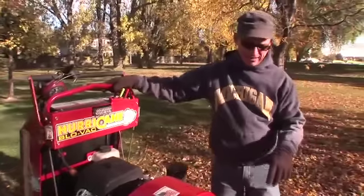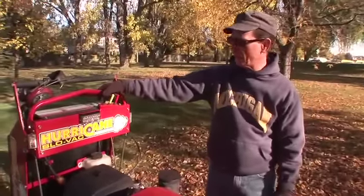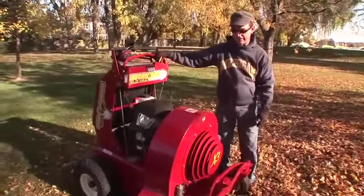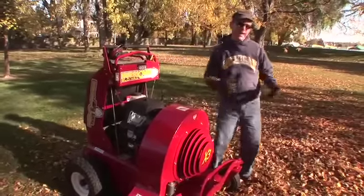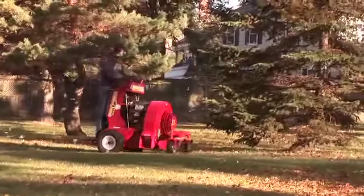On the right-hand side, if I've got the door open on the left hand and also the door open on the center, if I need that air coming out the right, I just flip the switch and it automatically has priority and the air comes directly out the right hand side. Shut them down as you need. That way I don't need to back up all the time. I can go forward, spin around, come back, keep my pile of leaves flowing all one way.